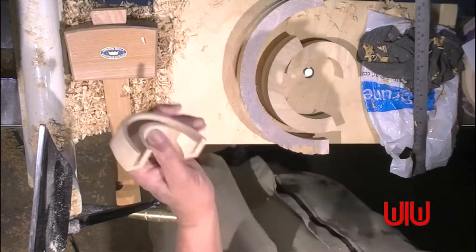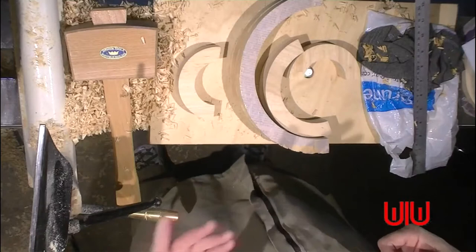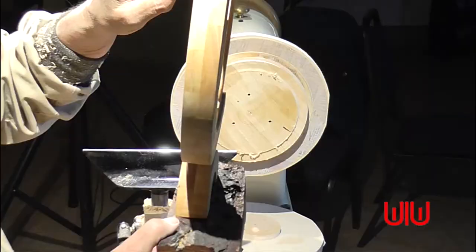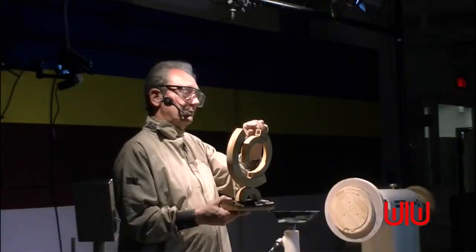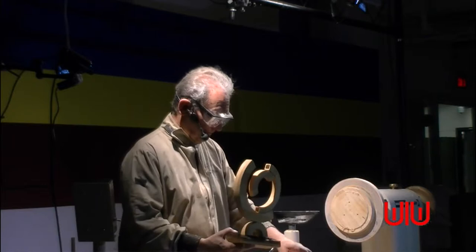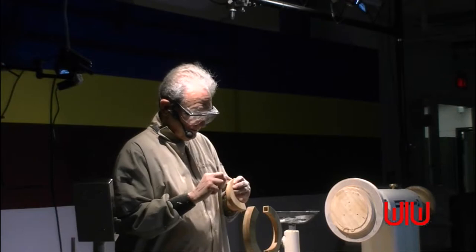put it together. Now, putting it together, as I just found out today, is somewhat problematic because the joints in here are, as I found out, quite fragile. And what I did in here, on this one, I put short little dowels with carpenter's glue and glued it together, and I put a little drop of epoxy in between. It didn't hold. It fell apart in the box. So I would redo this with, I would sand some of this away here, get back to raw wood, and re-glue it with epoxy.